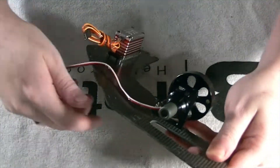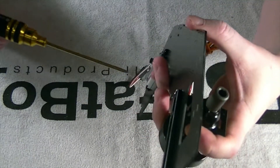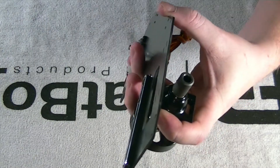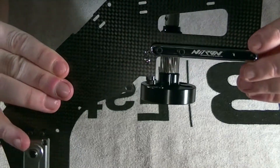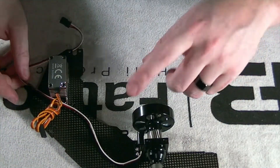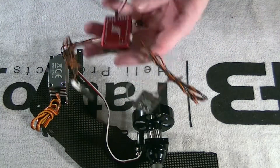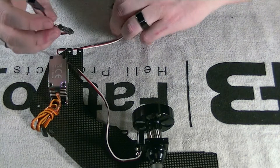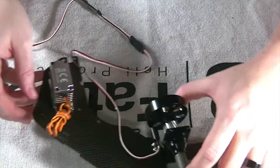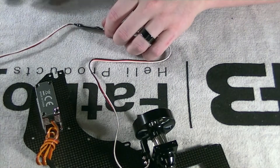I installed the throttle servo as you can see — that's pretty straightforward. What I'm going to do is bias the clutch stack all the way back and grab my tool to lightly tighten it down, just enough to lock it into place so it doesn't move on us. This is as far forward as the clutch stack can go towards the nose — I can't push it anymore. What I'm going to do is check to make sure that my magnets are sensing correctly first before I seal up the machine and move forward. I've gotten out my flybarless system — you can use any active power source in this case — and I've got my sensor rig here and I'm going to plug everything in.